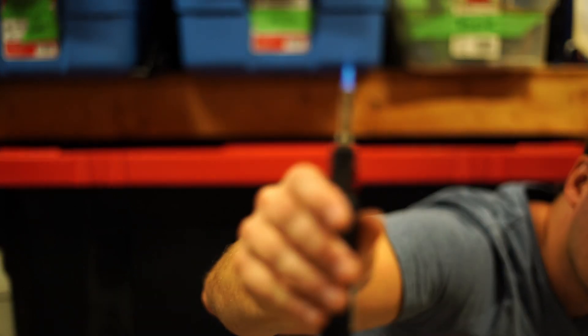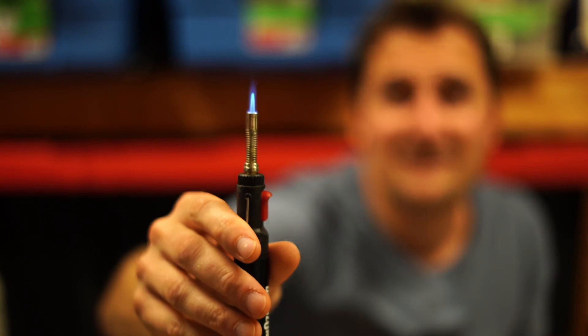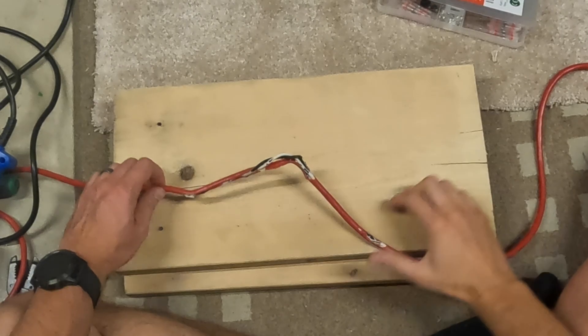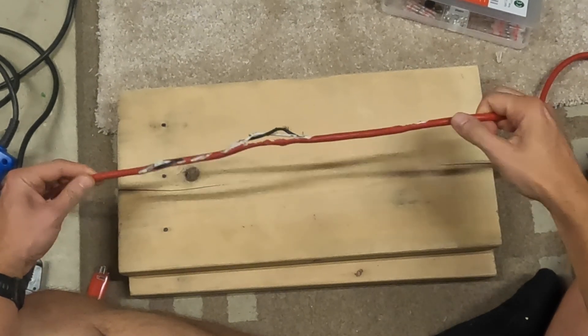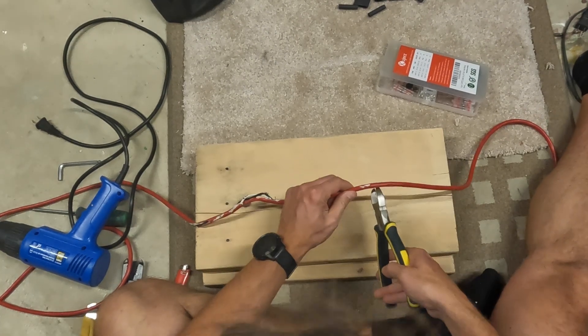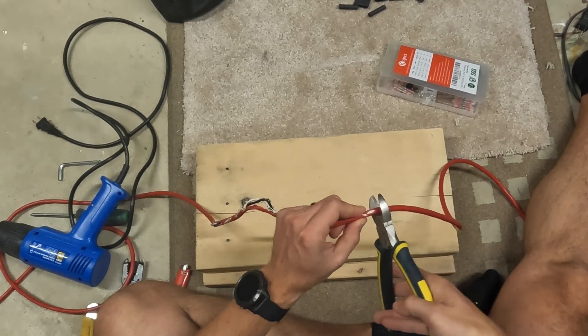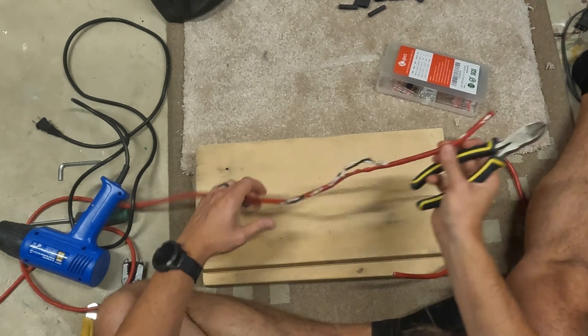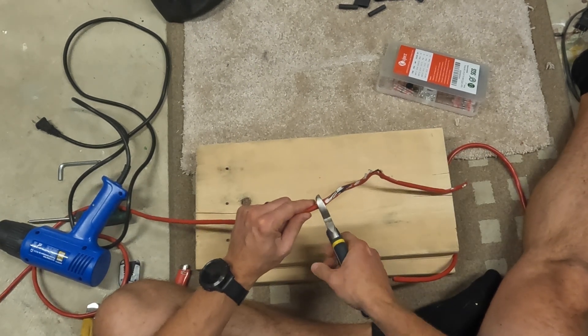There you go — you can see exactly what I'm talking about. You can see my extension cord, and this was all rabbit damage here — they were pretty bad this year. So first things first, I'm going to start by cutting these damaged sections off. I've got my side cutters, I'm going to locate my damage spots and cut just beyond those on either side. Now that's our damaged section of wire — we can toss this out and focus on the good sides.